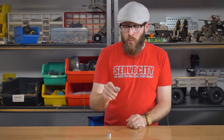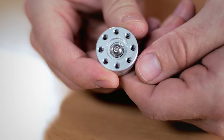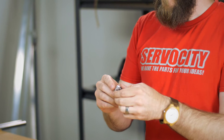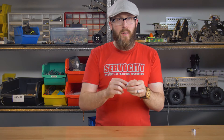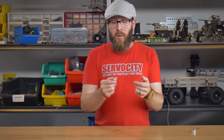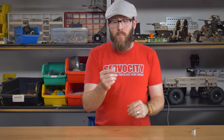Let's go ahead and take a look at the swivel hub for just a second. The swivel hub basically is two sides that have a screw going together and a lock nut holding them together, and they've got some ball bearings in between. This is great where you need to take a little bit of load off and you have a compact space requirement, especially since you don't need to worry about putting a shaft through and keeping it from sliding.